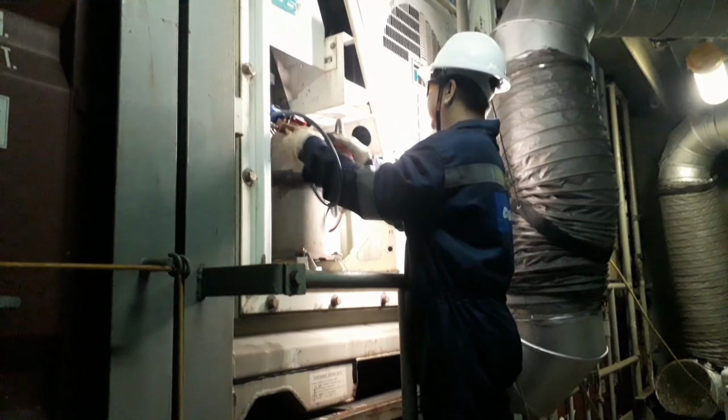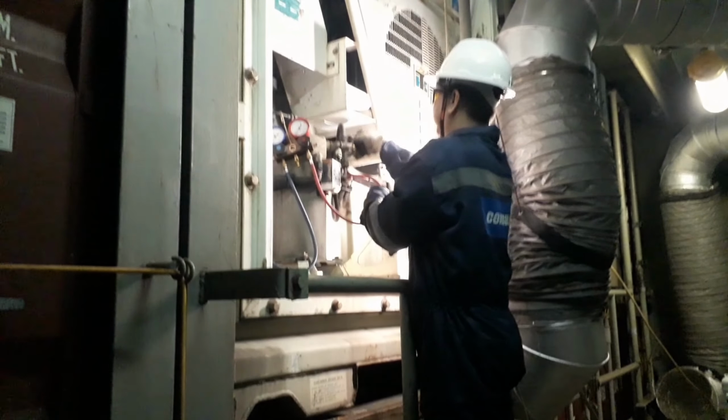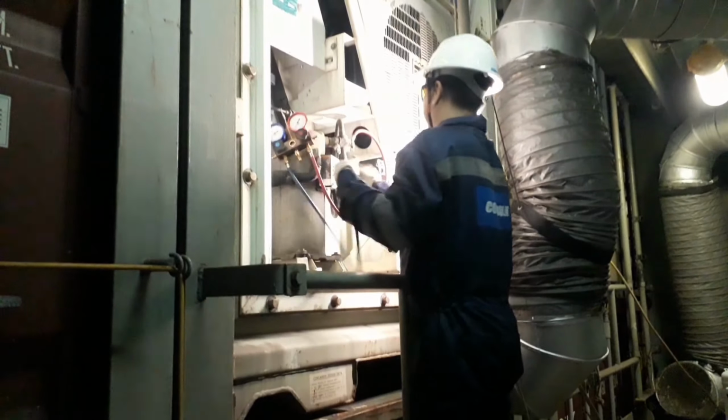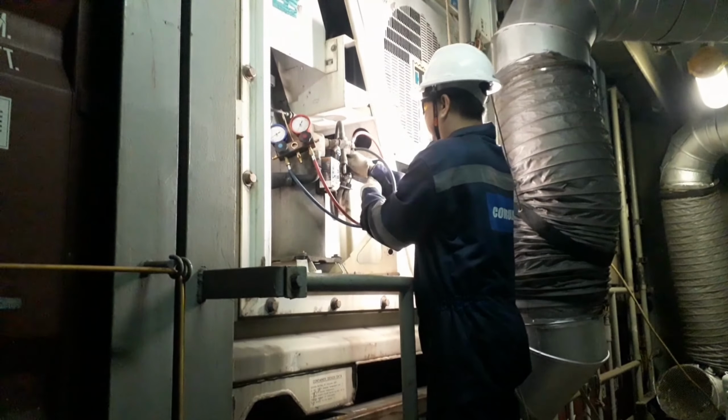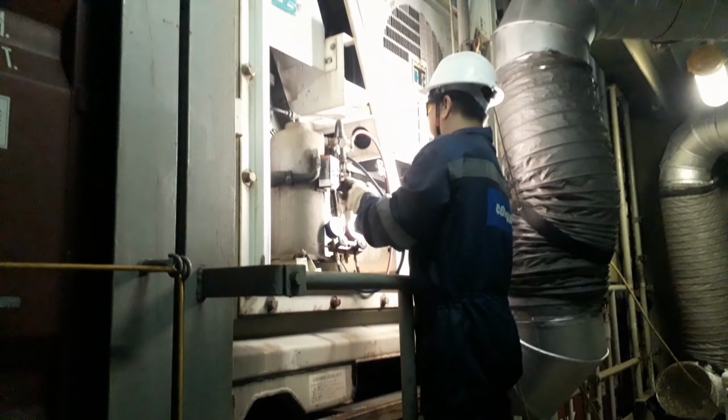When working on a repair container and having a major fault or defective compressor, you need first to make a report and inform the office before you carry out any further work. It requires permission from them to use the spare part, and you need to request replenishment for the spare that you consume.